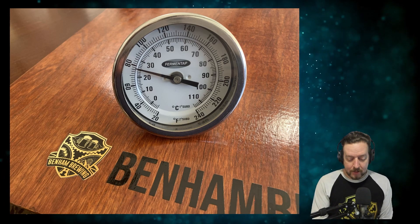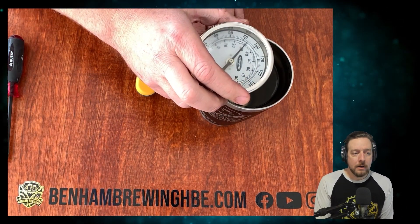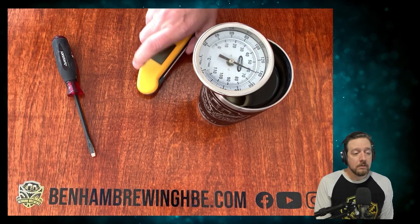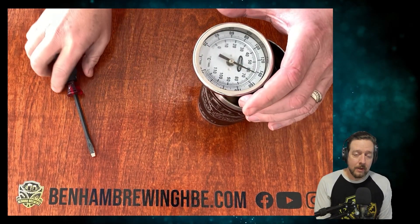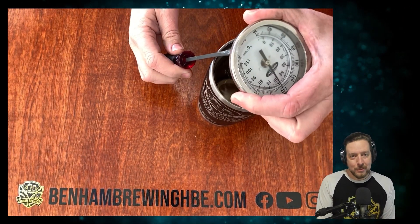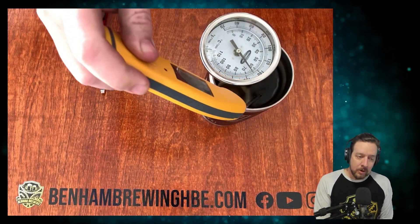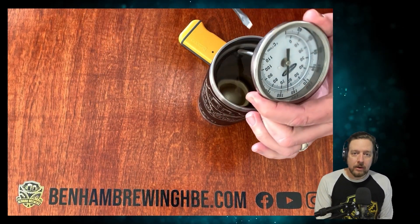The better thing to do — what I like to do — is make sure I have a good instant-read thermometer with me. I use a Thermapen; it's about a second and a half read time. I'll get a cup of water in an insulated container so it doesn't lose heat, and I'll heat it to what I usually mash at — 150, 155 degrees. I'll hold it there, stick the thermometer in, let it come up to temperature, which takes about a minute or two, then verify that temperature with my instant-read thermometer. I'll take a screwdriver and adjust the dial so it's accurate. I do it a number of times because as soon as I pull the thermometer out the temperature starts to drop. If you can keep it in the liquid while adjusting, great — I wasn't able to. So I'll take it out, adjust it, put it back in, let it come up to temperature, stabilize, check again with the instant-read, and adjust a little more until I get it as accurate as I'm comfortable with.